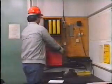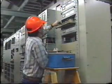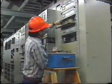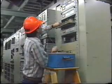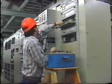Stay alert and keep abreast of safety procedures at all times. Good housekeeping is extremely important while performing tests. Cables, wires, and tools spread around the work area are certainly conducive to accidents. All connecting leads should be kept neat and routed out of walkways. Remember that a relatively small accident — say, tripping over a temporarily connected cable — may conceivably cause the victim to fall onto live terminals on a panel, possibly inflicting considerably more injury.